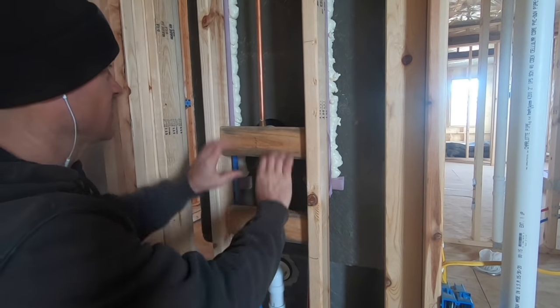Next, this little piece goes on here — this is what the grooves your handle will go on to. That just slides on like so. Screw goes in the middle — snug that up. Your cover goes on. And then this piece here has threads inside which will thread onto this cup so you have no visible screws — it just literally screws on like so. Just snug it up and that's it — that's all the way hot.